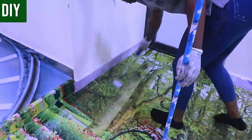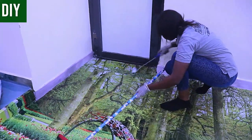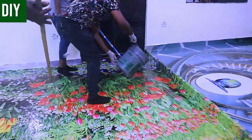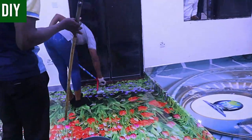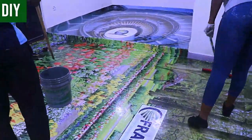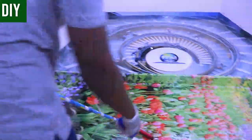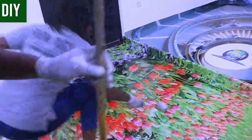Pour the FSC 900 and spread it from the farthest point inside the room, walking your way toward the door. This is because you cannot step over the FSC 900 to touch up — so it's better to walk from the edges and the farthest parts toward the door. When you get to the door, you know you've covered every area. Cover it completely and walk your way out.